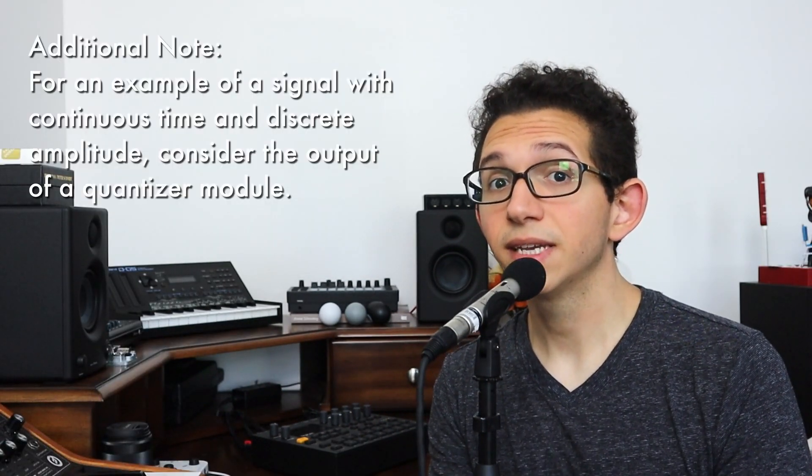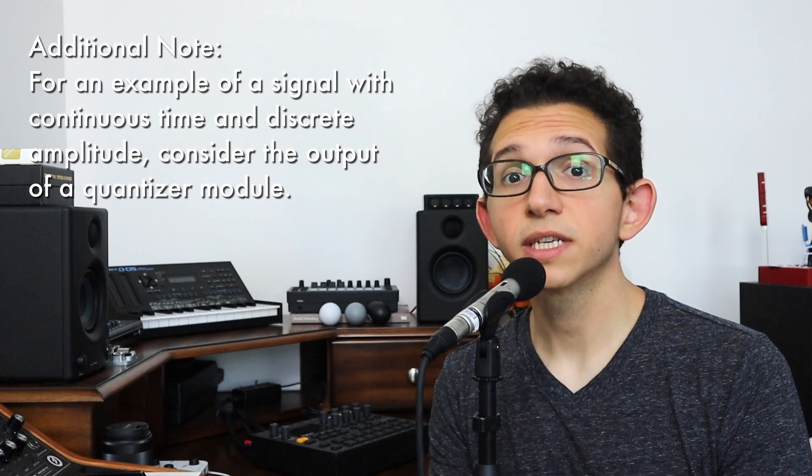The implications of this are kind of massive. We've moved from acoustic, to electromechanical, to analog, to something else. In analog signals, amplitude and time are continuous, but in a bucket brigade device we sample a continuous range of amplitudes at discontinuous time intervals. Because of this, our resulting signal technically isn't analog — it's discrete time.